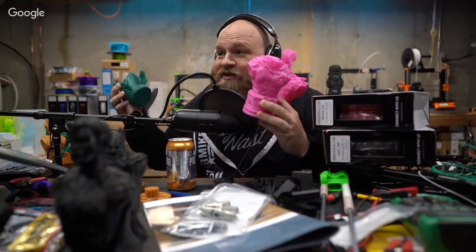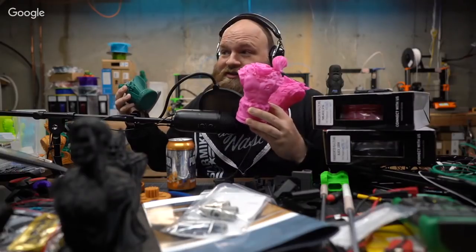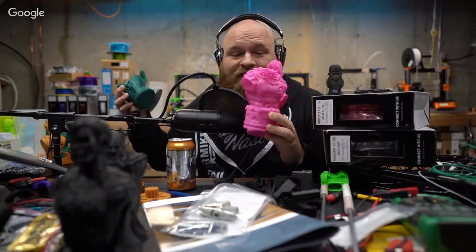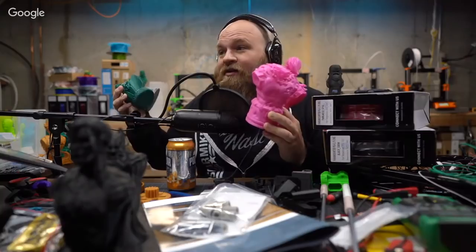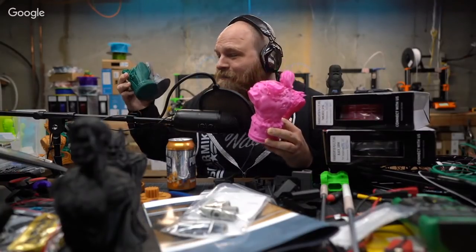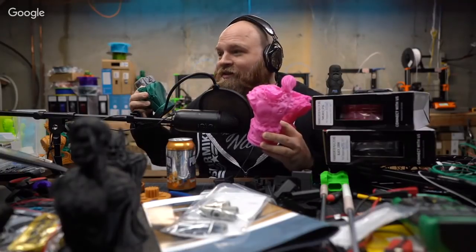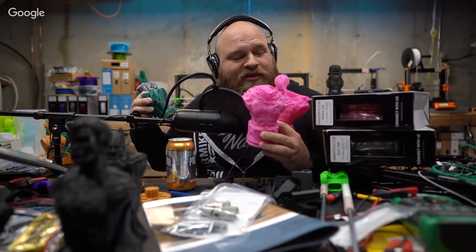And for some odd reason, I was getting X shifts. I was testing out some new motors, and we were getting X shifts everywhere. But now it's fixed. I don't know what I did. Oh, yeah, that's right, up the current slightly. A lot of headless jokers. A lot of bad prints.